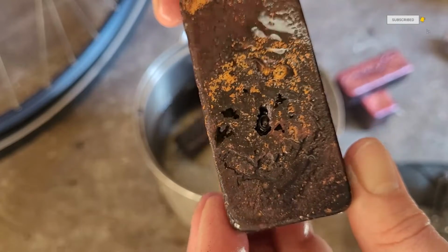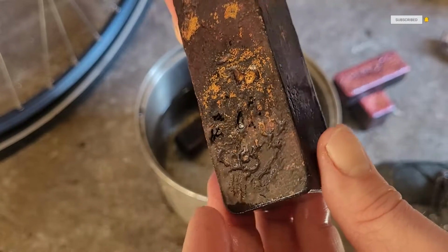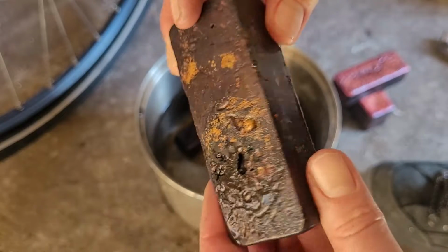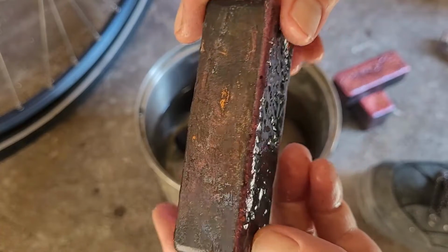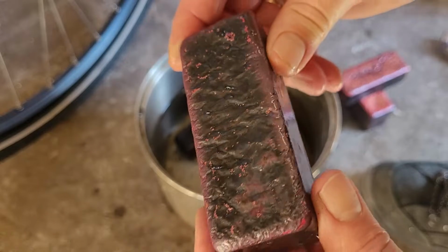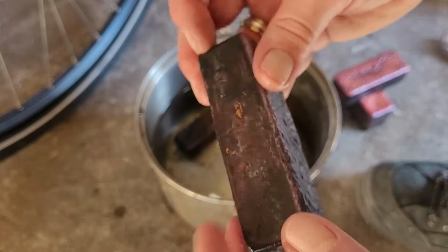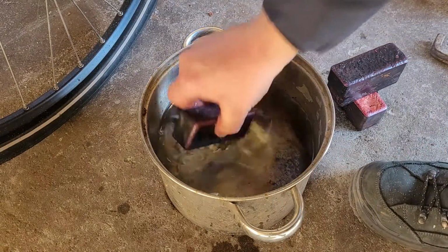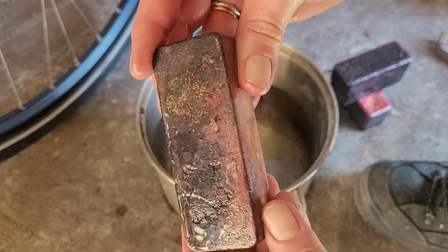Yeah, and I think the graphite molds were maybe not too cold, but mostly when I pour metals, the first ones have a couple of holes, and ones I pour next are better. But I have a solution for that. I might do that when I'm back from sailing with the Navy. I might buy some stuff that could help me out. I need to have some new ingot molds and some spray, what you will see in the future.